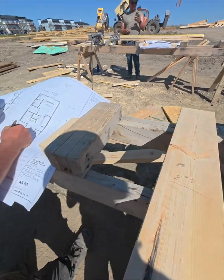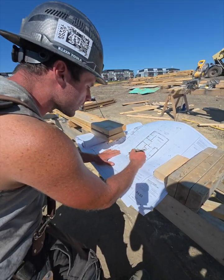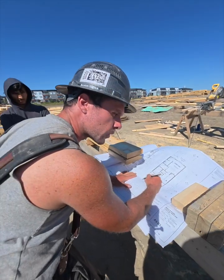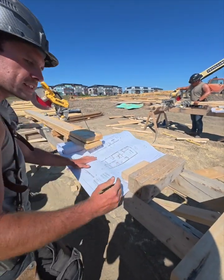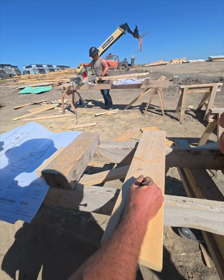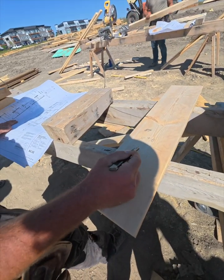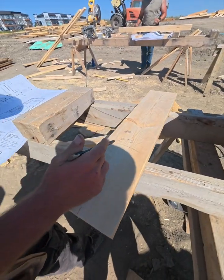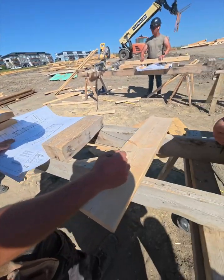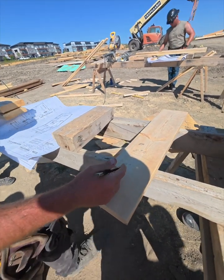So we're gonna just minus this wall's width from this wall, and I know that it's a 2x6 wall, and it's sheeted with drywall. So the drywall is 5/8, so it's gonna be 6 1/8 is what I'm taking away with that. So it's 8'9" 1/8 minus 6 1/8. I would always use my calculator. I always double check everything I do, but I know for a fact that it's 8'3". So the plate measurement's 8'3".